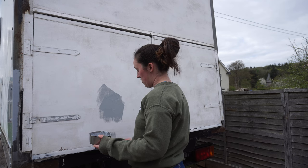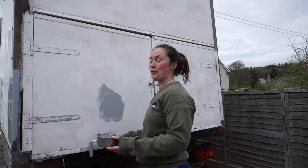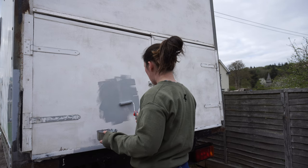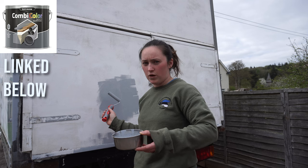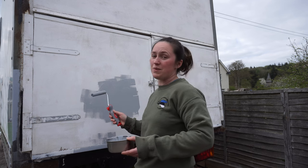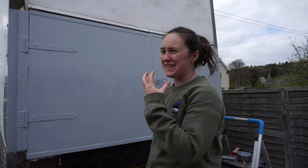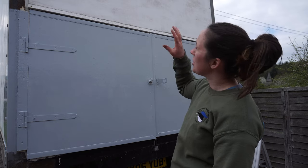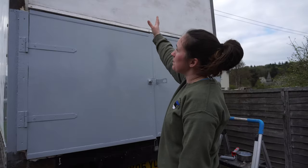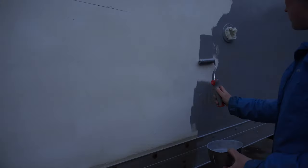So if I make some mistakes back here, the best it can be is homemade anyway — testing some stuff out. With this paint I've gone four parts paint, one part thinner, as recommended in another video I watched, which is good because it makes the paint stretch a little bit further. I do love the colour — it's like a blue-grey light colour. Now I'm going to grab the big ladder, do the same process above: wonder wipes, tack cloth, get all the dust off, then paint.